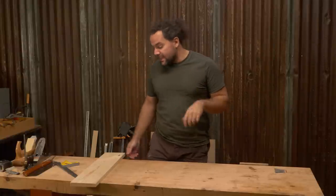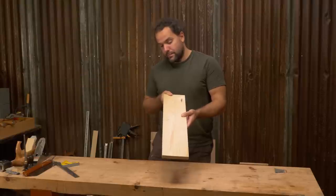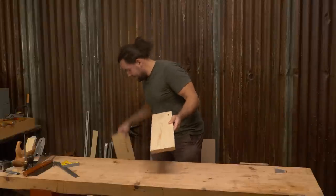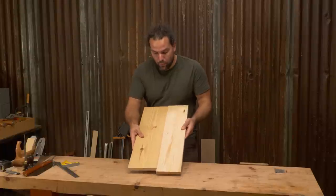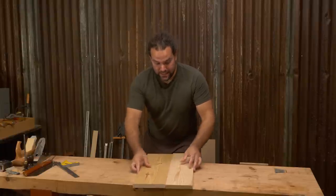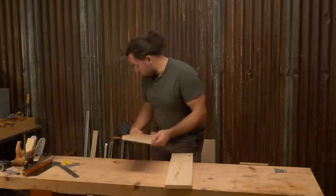I've got something today that might help some people who are struggling with edge joints. Edge joints can actually be quite a tricky thing to get right, particularly if they've got to be glue grade. You've got to bring two boards together and get them just right. What you're wanting is almost that little gap in the middle that gives it that spring, so you can basically just put one clamp in the middle and the ends automatically self-pressure.